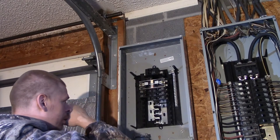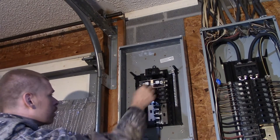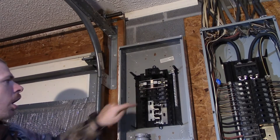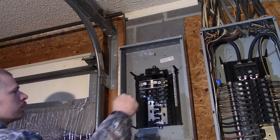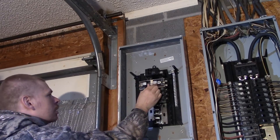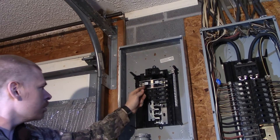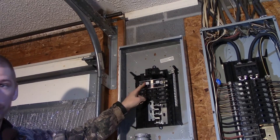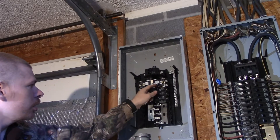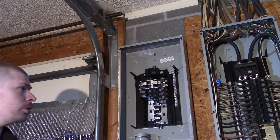I see how it works. It's guaranteed not to turn one on at the same time as the other. So you turn one on, and if you go to turn this one on, it will automatically shut this one off. It won't hold them both on together — both can be off at the same time, but both cannot be on at the same time. The power goes in from the breaker panel and you have to turn each one on separately. So it's just a manual transfer switch. It's real simple, it's only $23, and it resolves the problem immediately.